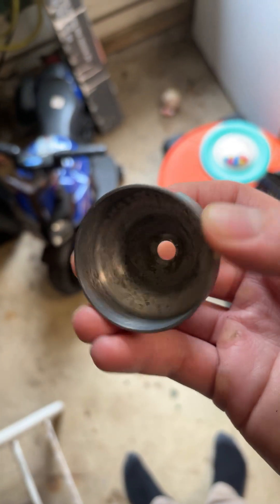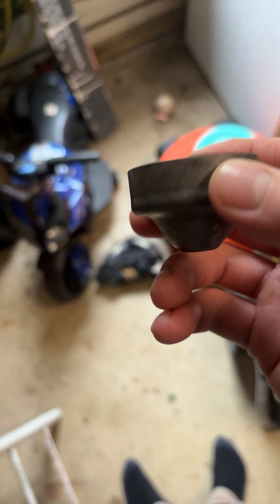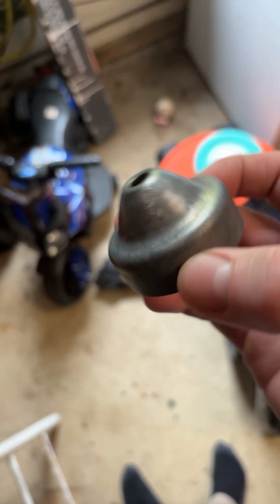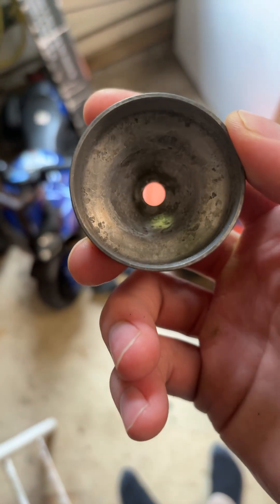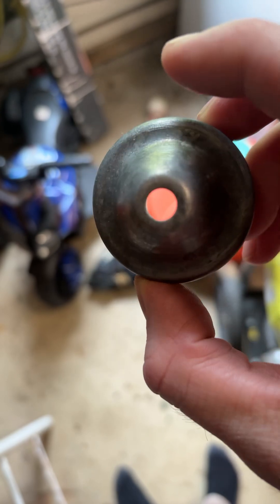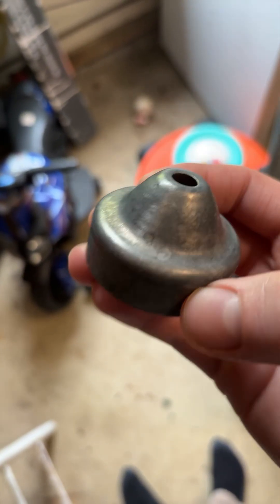That coating is really going to help prevent it from rusting. It's also a bit of an experiment to see if that can be done with a steel part like this — a carburetor bowl — and if it's going to fit. It should be fine because people use it on gun parts that are precise and can't be warped. This is pretty crappy metal, so we're going to heat it up, dump it in some vegetable oil, and see how it comes out.